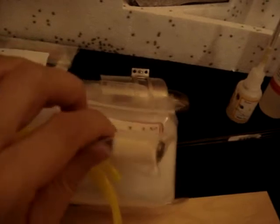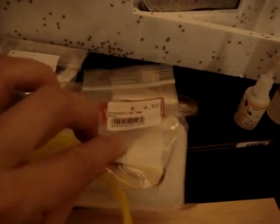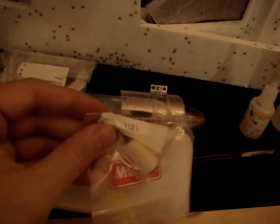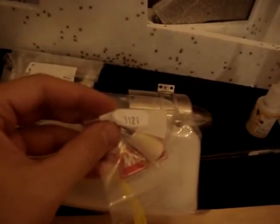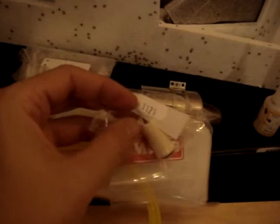We have M-Bond, and then we have a Tygon tube for the tank. We also have a felt pendulum to put in the tank to avoid air bubbles. We use a felt pendulum to reduce the risk of getting air in the fuel tubing of the turbine, because the turbine will stop if there is air in the tubing.